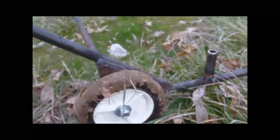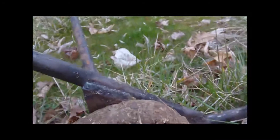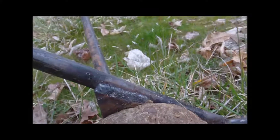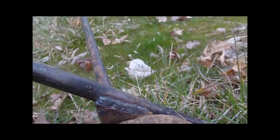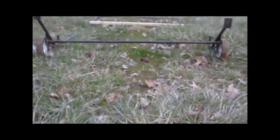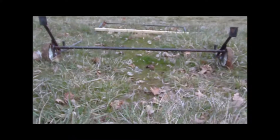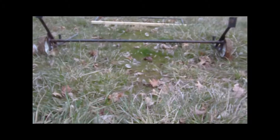This is the outside. You can see that 45-degree cut on the flat bar, and then it's welded to the bar there. I'm going to come around to the front to give you a profile look at the whole thing. There you can see that the axle runs across well above the bolts that hold down the wheels, to give good clearance.